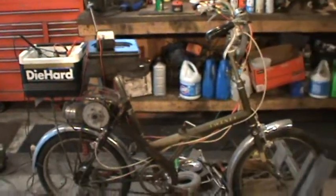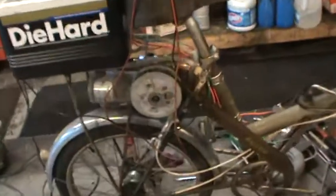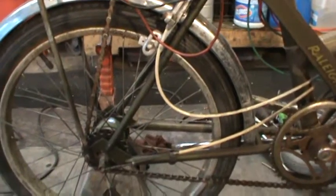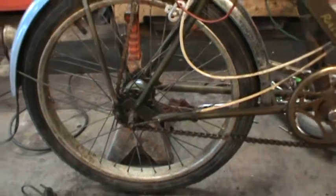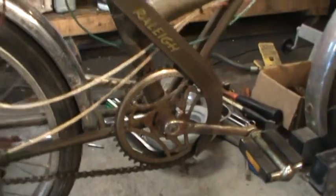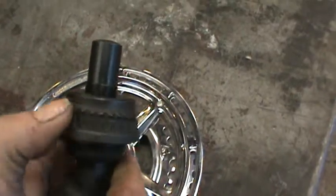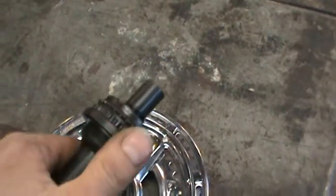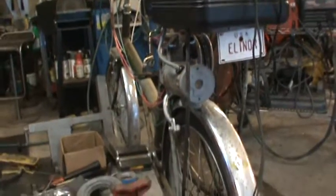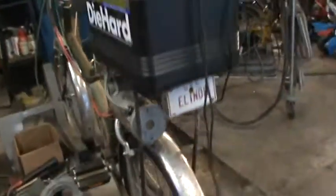Other than that, I think I learned what I wanted to learn as far as how this stuff works. If I do it next time, I want a separate power source going to either a different sprocket. The trike that I'm going to make — I'm going to power one wheel, the sidecar wheel, electrically, and leave the bike part to pedal by itself. Everybody was asking how come the pedals still go around. I do have something for that — this sprocket goes in this hub, and the hub has a ratcheting effect so your pedals can stay still and the sprocket will still turn, kind of like the rear wheel does. Whether I'm going to put it on this one, I don't know. This will probably get put away until I make the other one or come across some cheap battery sources.